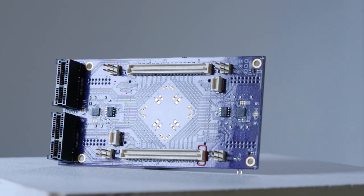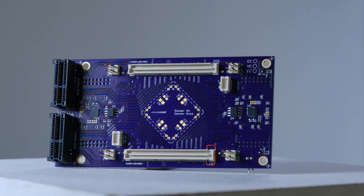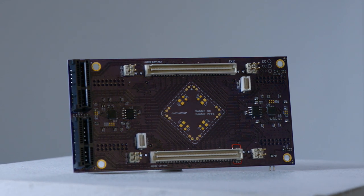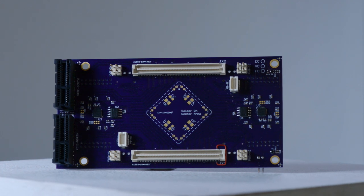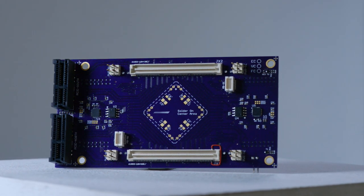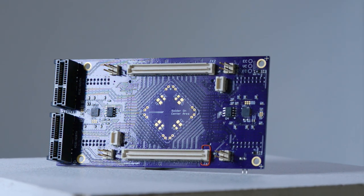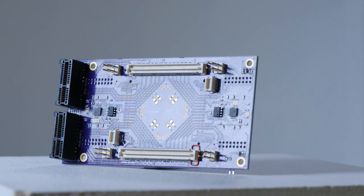This can be dynamically reconfigured in software, which opens up a lot of new possibilities. In the center of the beta main board, we have a solder-on area which is not populated yet. In the future, it will host chips that sense the camera's orientation and acceleration. These are the same chips that are used to stabilize quadrocopters or track head movements in virtual reality headsets. In our case, these sensors are placed exactly behind the image sensor center, so they are in a perfect place to supply data for image stabilization or metadata about camera movement and orientation during a shot.